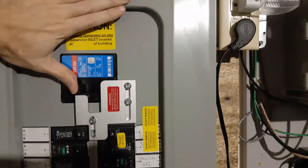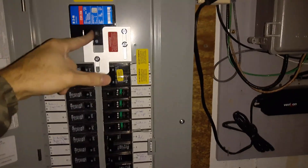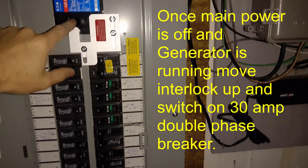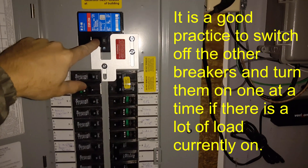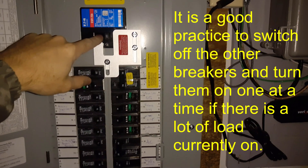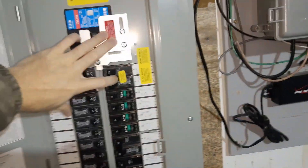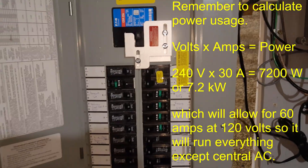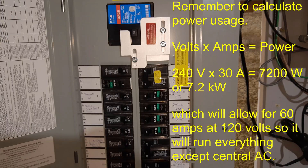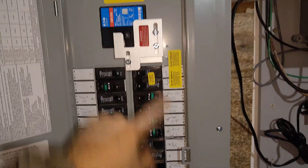First, I'm going to turn this off so the lights go out — I have a flashlight with me. So I have the main power off. That's very important because you don't want to put power back to the line. If the power lines are down, you don't want to get anybody electrocuted working on the lines with downed trees and things. So we have this interlock — we push this up, flip this over, and now the house has power. We are now running on generator power rather than line power. Mains are off, generator power is on.